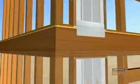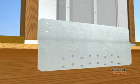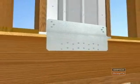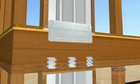The SSW shear transfer plate is then installed on the outside face using 10D nails in the rim joist and number 14 self-drilling screws in the upper strong wall. Install the specified number of LTP4s from the rim to the double top plates.